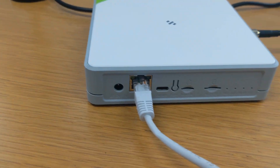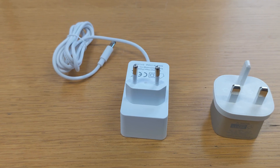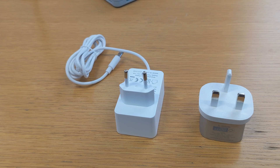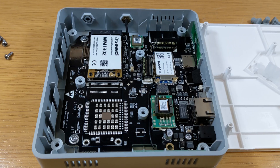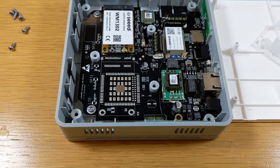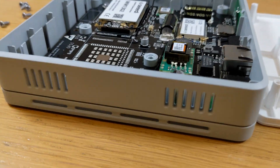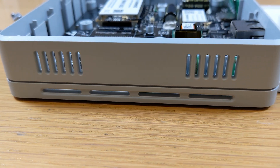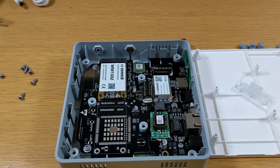One thing to note about this unit is PoE is built in, which is absolutely fantastic. It's one of the great features I like about newer hotspots. They sent me an American plug, but I just don't have to bother with it — I've got a PoE switch I feed off. As you may have heard about light hotspots, this is running on a 580 megahertz processor with 128 megs of RAM. It's also got on-board flash of 32 megabytes, and the LoRa card is an SX1302, so it can do up to 26 dBm of power. The PoE standard is 802.3af.